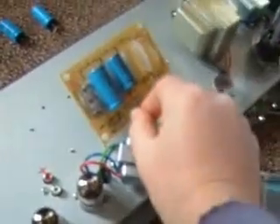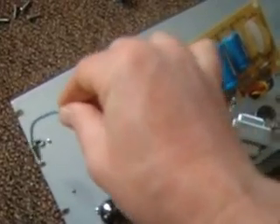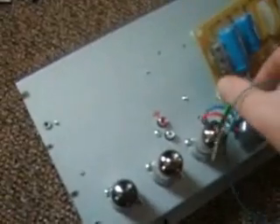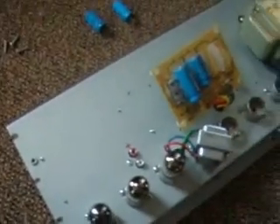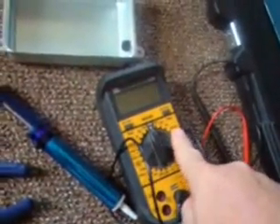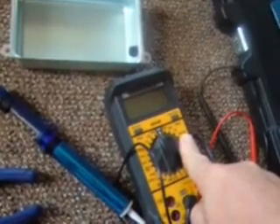So the next thing I did — I wasn't touching the amp at the time — I put it on the positive end and I found where this little weld was on the amp because it's very raw metal there. I basically did that to each one, being very careful not to shock myself. Then I used my multimeter on volts of direct current to test it and make sure each one was dead.